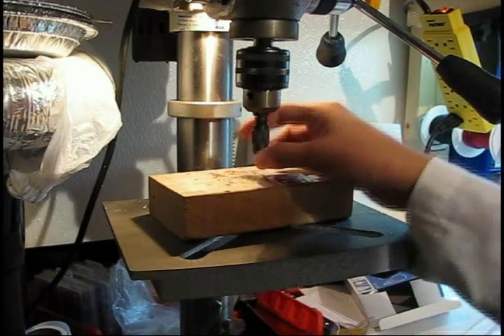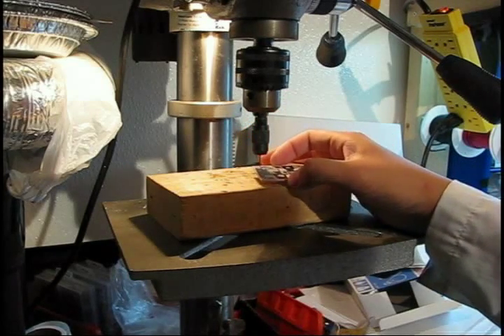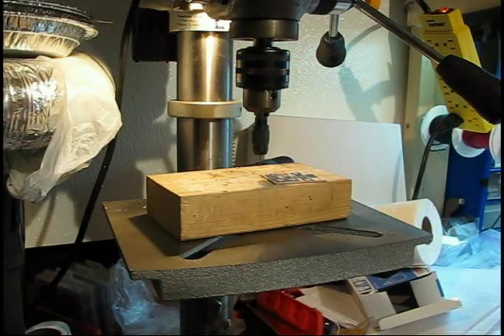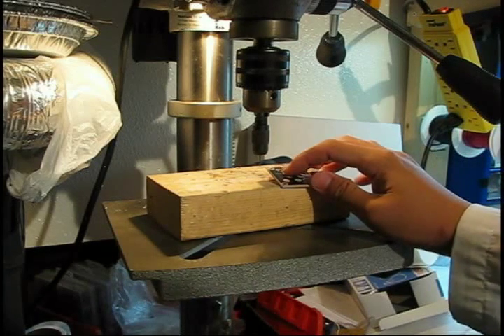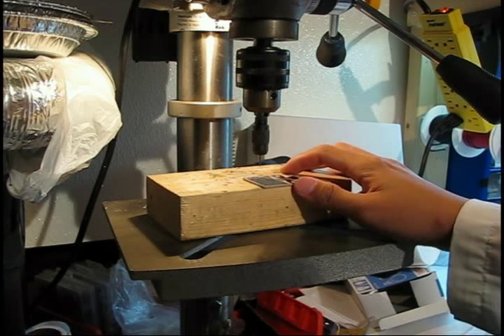You want to be very careful when using drill bits — please wear eye protection. The alternative to high-speed steel drill bits in a drill press is tungsten carbide drill bits, which are used in industry to actually drill circuit board holes. They are very tough and resilient; however, they shatter fairly easily. It's a bit of a contradictory statement, but let me explain.